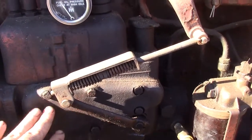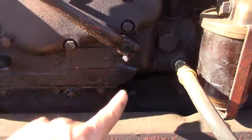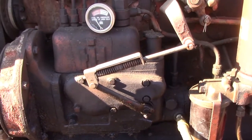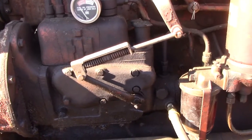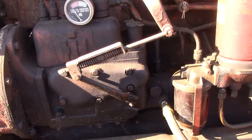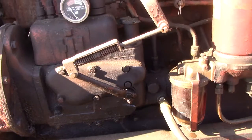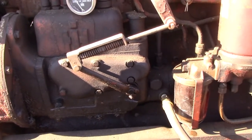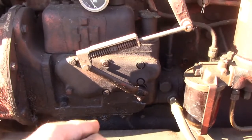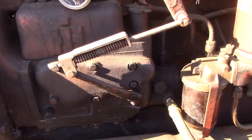The A models had a scavenging valve right about here, I believe, that there are some O-rings on there that can go bad, or the scavenging valve itself is sticking. So all you need to do, take yourself a 1/8-inch pipe, a small nipple or something. I use brass just that way it doesn't chew up the threads if something would happen to strip. Thread it onto there. I take a pair of vice grips, snap onto it, and then pull it out that way. Pretty much all the ones I've taken apart have all been sticky.